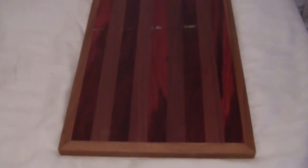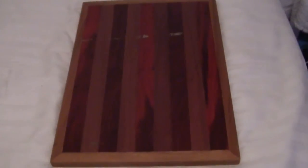On the backside I'm doing the same thing. Here we have just where the board was sitting. It really doesn't matter about how it was sitting, because what we do is put on a lot of wood sealer first in our spray booth, and then we put on a lacquer finish, which I've done.